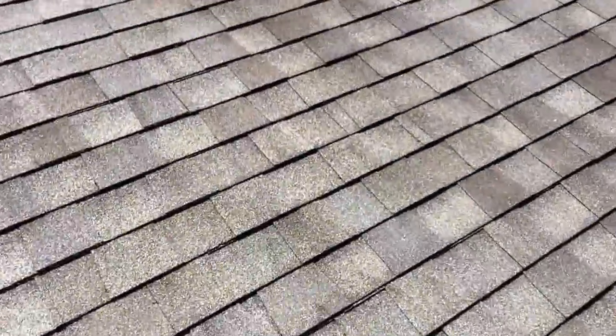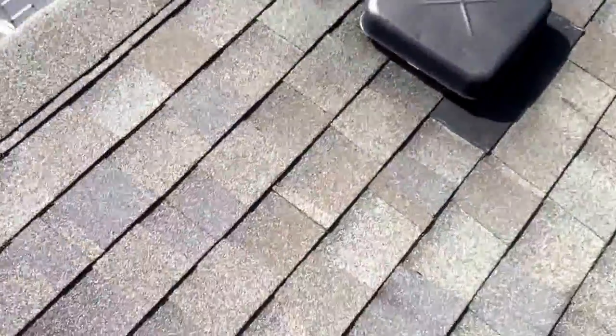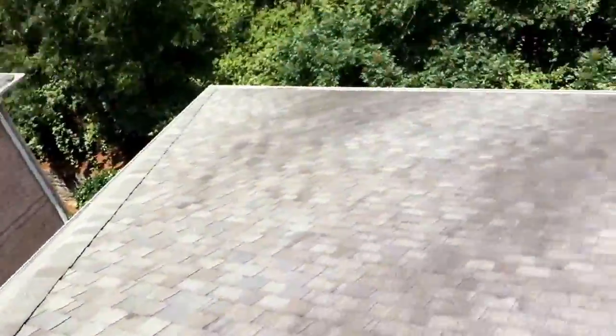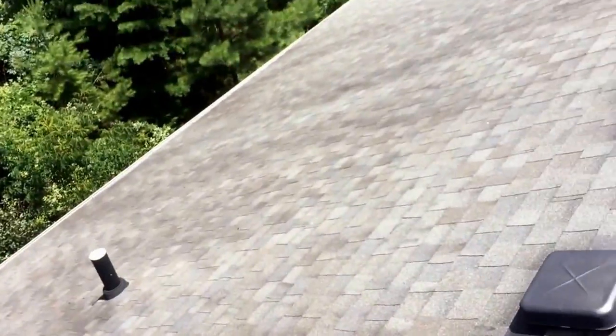None of that was ever caught. So really just some preventative maintenance stuff. We'll get up here and caulk all the toe board holes, repair those, caulk all the vents, and add rain collars, and you should be good to go. I'm Casey Beaver with All Roof Solutions. Thanks.